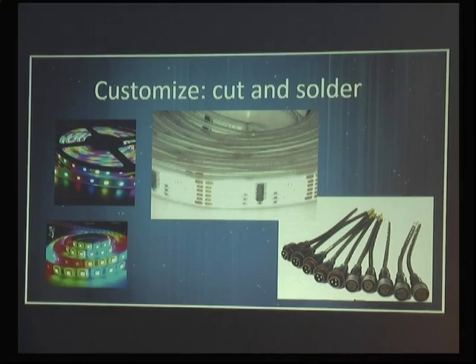Putting these together involves a lot of cutting and soldering. Everything is custom sized — each element gets cut to the length you need as you build smaller props. You can add strings together or cut them down. Connectors on everything are essential so when something fails you can swap it in and out, and when you store it, you can disassemble it into smaller parts and shove it into nooks and crannies around your house and garage.